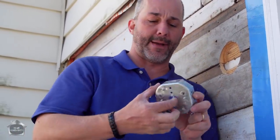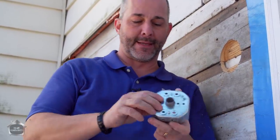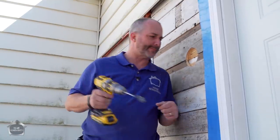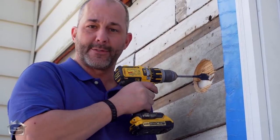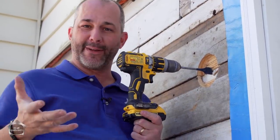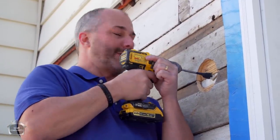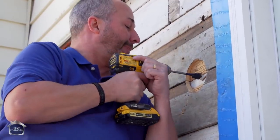Take out the cutout hole in the back of your box, then put in your connector, and you're going to want to recess that right in the wall. Before you can do that, you've got to drill a hole for the connector. Now, we're doing the rustic modern farmhouse look here — a lot of open concept, old-looking exposed wood — but when choosing fixtures it's difficult. I'm curious to know if you'd like to see more of an antique look, like a carriage lamp, or something more modern. Put your answer in the comment below — I'd love to hear your opinion.